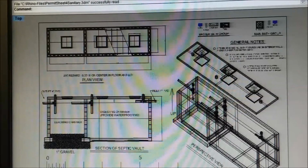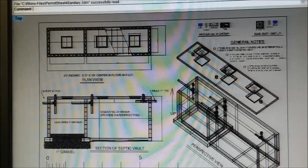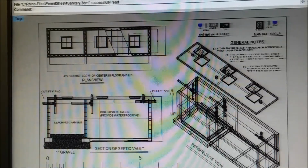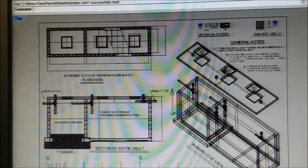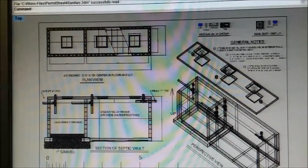Now you got to remember, this water's gone through the digester, and all the biodegradable stuff is out of it. It's nearly clear water at that point, sort of grayish but clear. Put a bunch of it in a big jug and look through it. It's got a gray tint to it, but it looks like clear if you just dumped it in a water glass. You can water plants with it. In our case, we're putting baker's yeast in the second digester, and then dumping it into the third one.